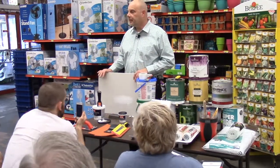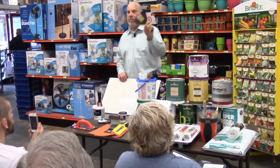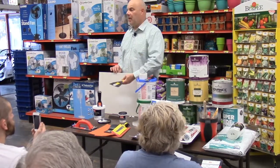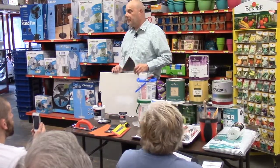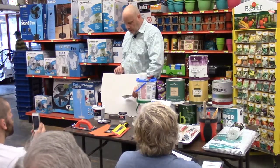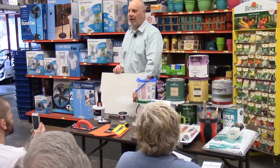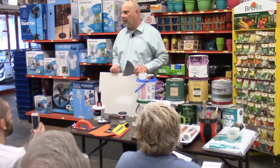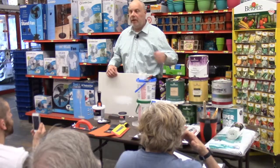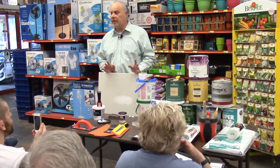Not necessarily heavier, but definitely wider — you'd want to bring it out to the full 6 inches of the blade, and eventually up to a 12-inch blade depending on the size of the repair. The height gradually tapers off back in, similar to how they do repairs on cars, except car repairs have to be a lot more critical because of the high sheen. When we get into paint, we'll talk about how sheen can affect your repair and what you want to do with walls that might not look perfect.